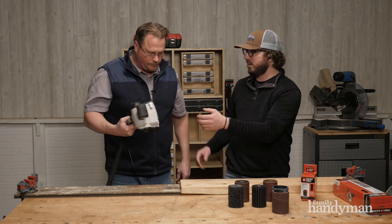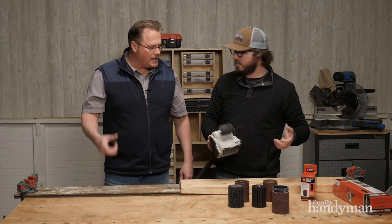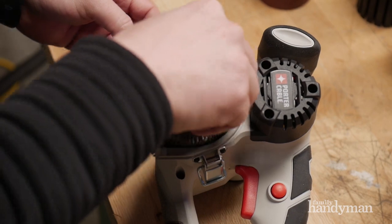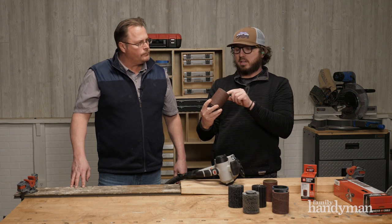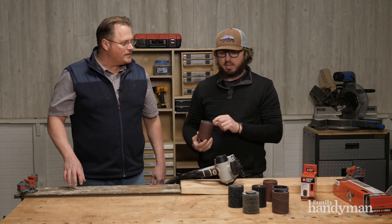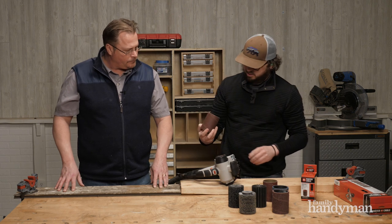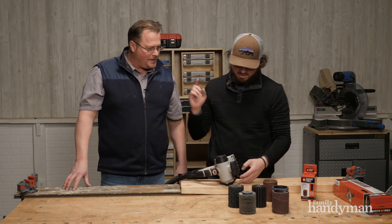That was just a little bit, and you had the trigger lock on. Fatigue-wise, you're not going to lose that when you're doing stuff like this. So I'm going to unplug it here, because what's really cool is how you change this out — it just comes out, this flap comes off, the roller wheel comes out. They also just released a new tool to help you get these papers off because it's a little hard. Once they're on, they're on pretty good. This one has a smooth sleeve with a key on the end that locks on. These are double-sided, so it doesn't matter which way you put them in — well, it says 'this side up,' so there is a little directional. You put the door back on and snap it in place.